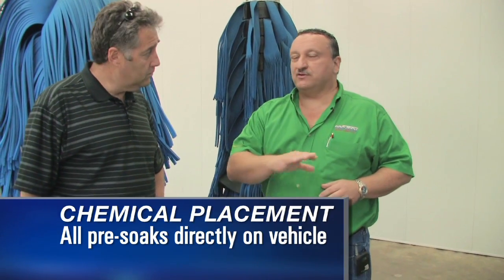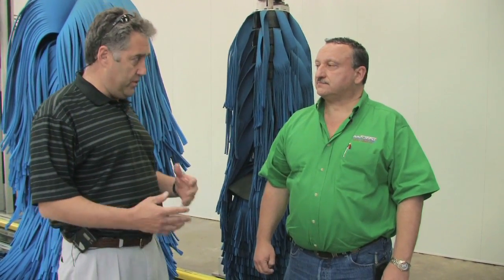And by the way, we don't use any soaps, we just use pre-soaks. What do you use to lubricate your side wheels? Are the pre-soaks applying enough lubricity, giving you enough slippery edging, so to speak, for the car as it's going through? Yeah, we don't have that problem because of the multiple applications. In addition, you have the reclaimed water that has soap in it already, or pre-soaks, and that's how we get the lubricity we need.